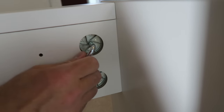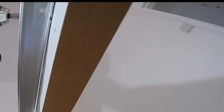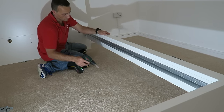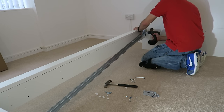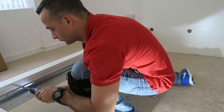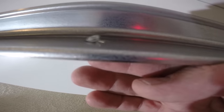A lot of people ask about this, but it's very simple if you follow the instructions. Now the rails on the side panels - just secure them in with the screws. These are going to hold the whole mattress and the slats. Make sure they're secured properly as they'll hold a lot of weight. There are also two small screws on the side - I'll explain what those are for later. On the other side, exactly the same. You can see there are two lines of holes on the side panel - you can choose how high you want the mattress. I'd suggest the higher position so when you sit on the bed you don't touch the wooden side panel.